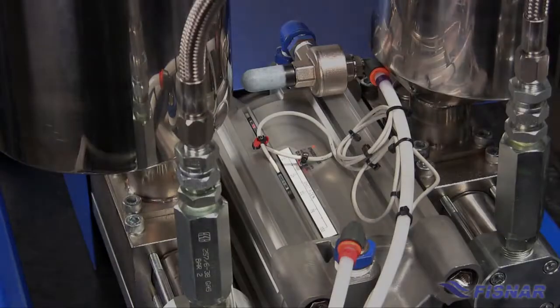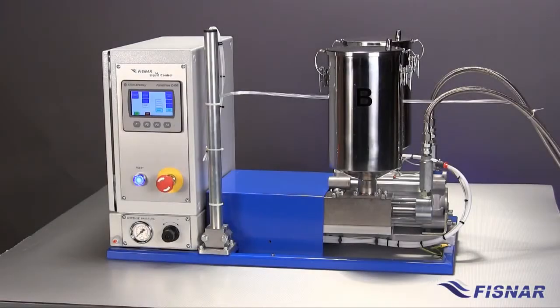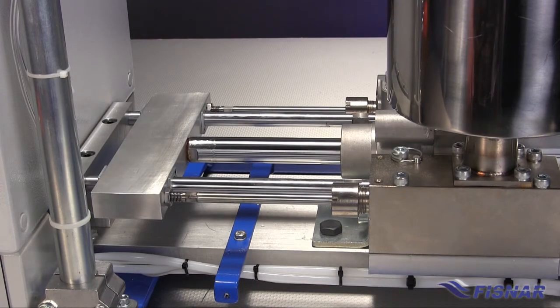The shot output is adjusted by a sensor, which sets the forward stroke of the metering pumps. LC120FR systems will meter, mix, and dispense fluids that are low to medium viscosity. Metering pumps are rod and piston designed, with long-life seals and precisely machined internal surfaces.